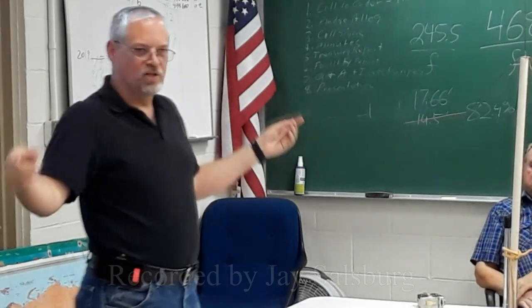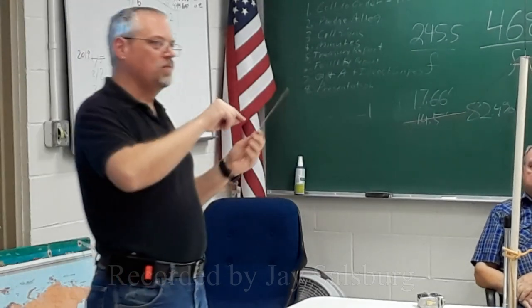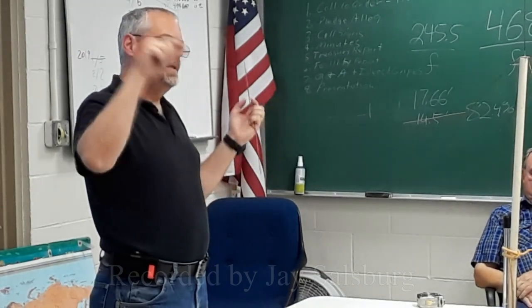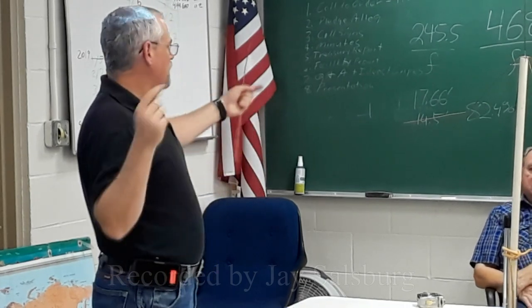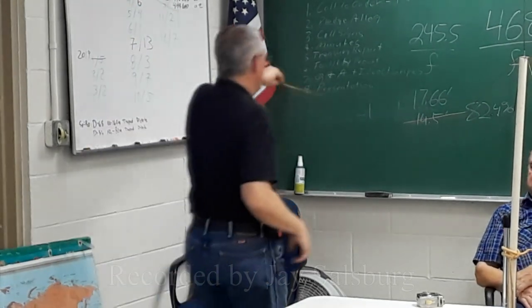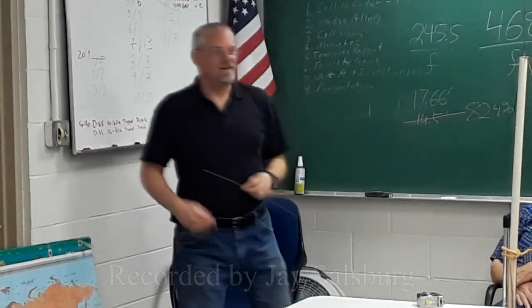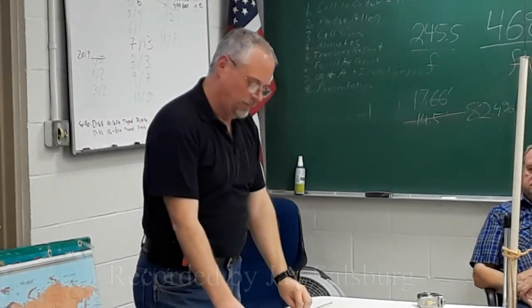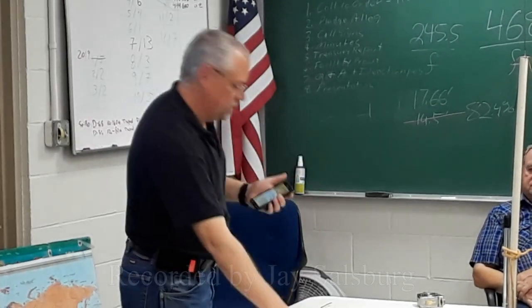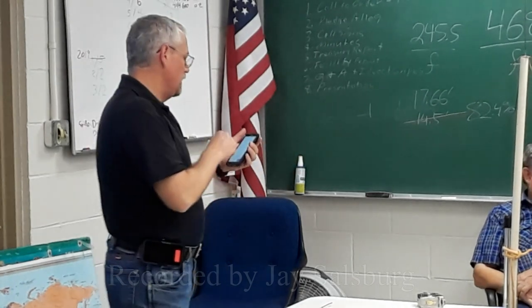That's how we measured the length of that. We measured it by finding the frequency at which the impedance dropped to zero or near zero. Then we calculated the velocity factor off of that. Now we can go back and ask, at 146 megahertz, how many would fit in that?